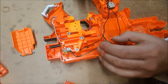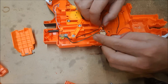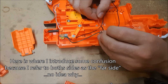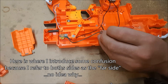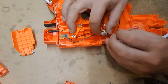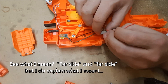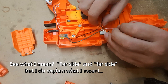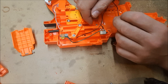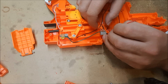You're going to test the positive wire that's coming off by going to the far side of the switch and connecting it there. If the motors spin up when you do that, then you know that this wire is okay. After that, you're going to go to the far side of the switch — to the part that is connected when you push the switch. In the case of these stock switches, the center one is the comm.